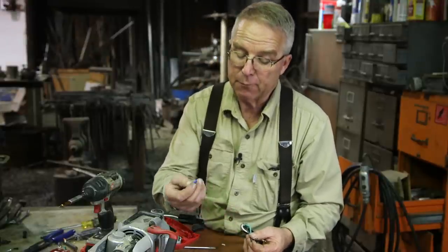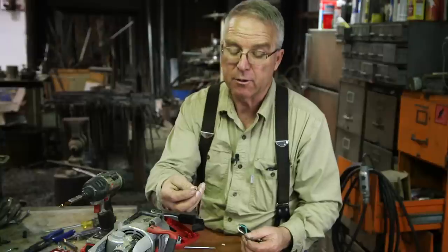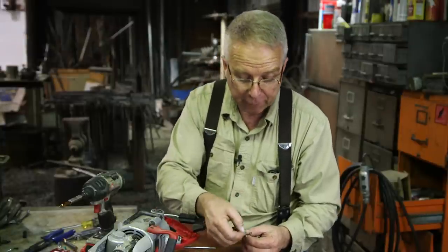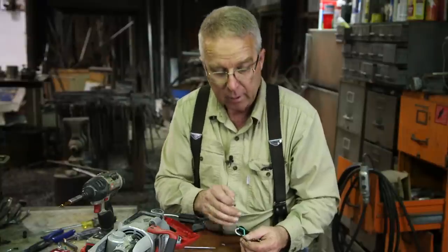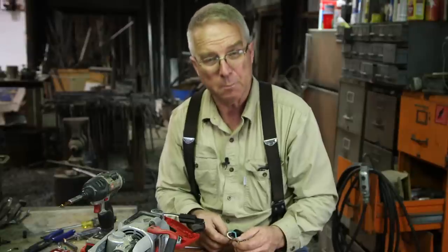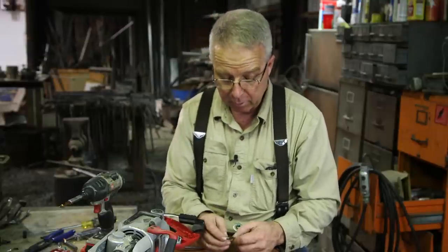The only thing that I've been able to find here in my community are these little guys that are made for 14 gauge. We're putting 12 on, so it's going to be a bit of a fight to slip this over the whole conductor. We'll see how it works. We may have to remove a few of the strands. That's probably not approved, but it's what we can do.